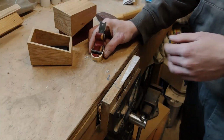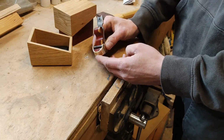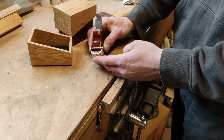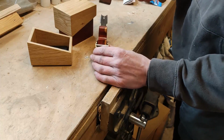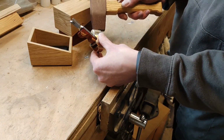So being a thumb plane, it's mainly for light work. It's great for taking off chamfers and arris edges and for curve work. Instrument makers would find it useful, as well as model makers. It's easy to adjust depth of cut just by tapping the top of the blade, or decrease depth of cut by hitting the back of the body.